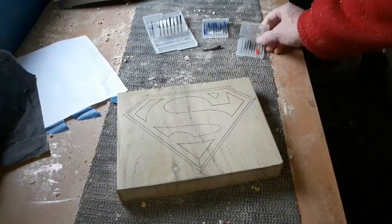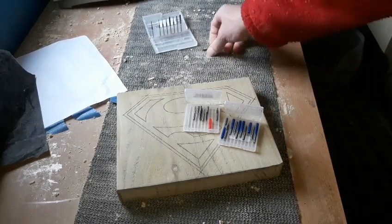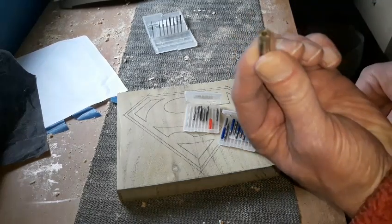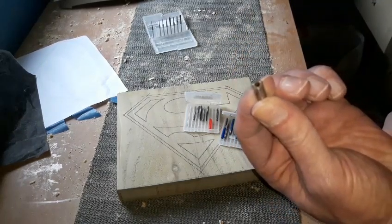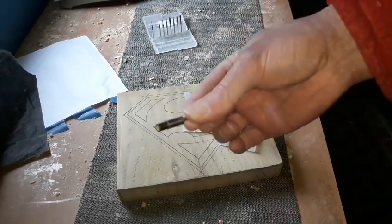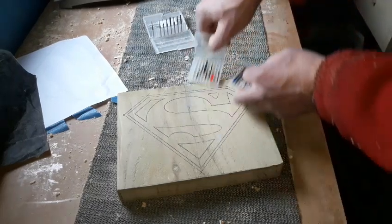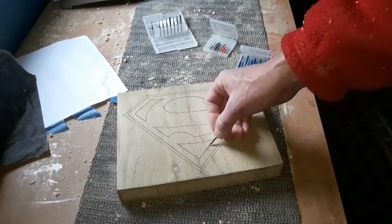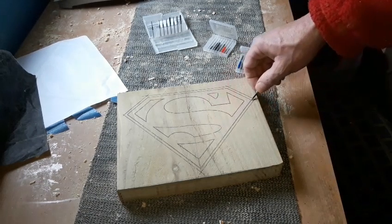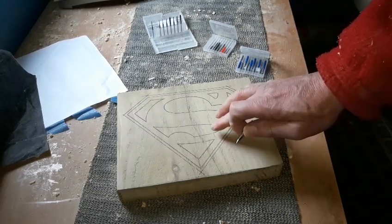As always for me, the CNC bits - these come in 20 degrees, 30 degrees, they do have a small shaft on them, a Dremel size 3.175 millimetre, so you will require a collet - a 6.35 millimetre to 3.175 - and that will just slot in there nicely. That will now fit your router with a quarter inch shaft in it, no problem whatsoever. We use that to go around these lines here to a depth that we need. Once we've done all that we'll also go around the outer one.